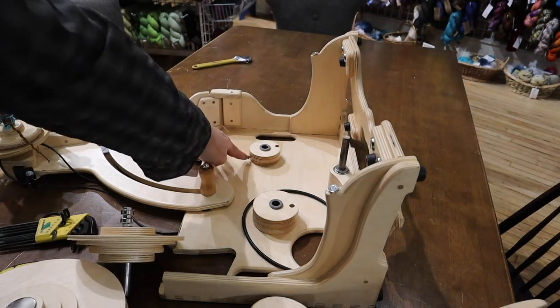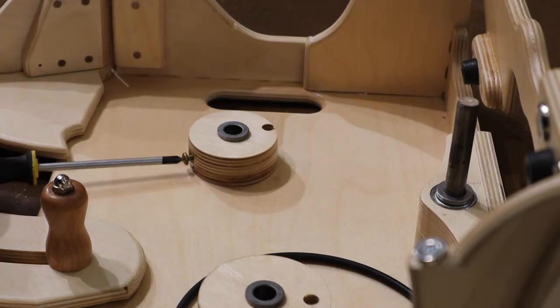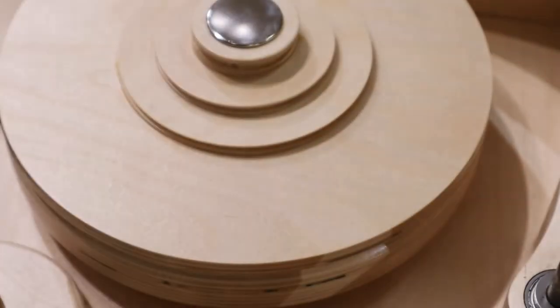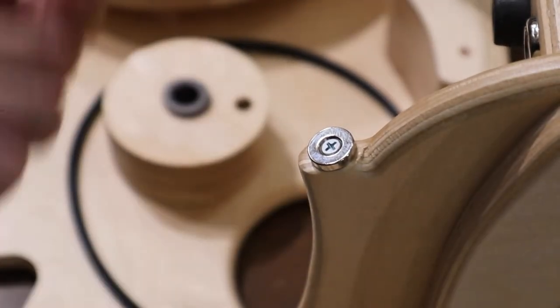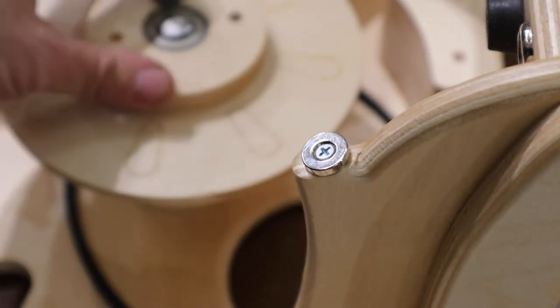You can see now there's the screw I had to loosen — you had to come in from right here to do it. That hole is the one that lines up with one of the three screws on the back of the main drive wheel. When you loosen those up, you can try to tweak the balance a little bit, tighten them up — it may take a couple of times to get it just right. The same thing is true on this one: there's a little hole, you come in from the back, and it adjusts one of these three.